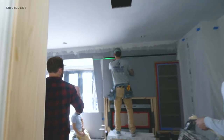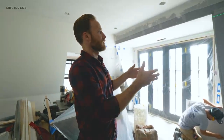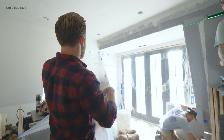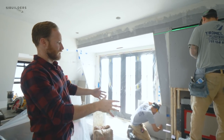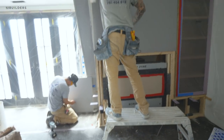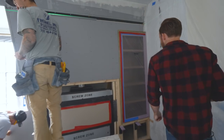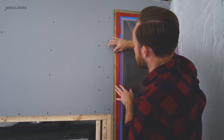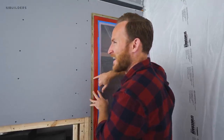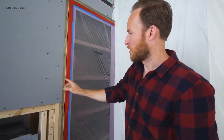The plasters are back on site - Colby and his team are working on this fireplace. At our Back Bay project we had that cubic concrete-looking fireplace; we're doing something very similar here using a product called Limestrong. Everything in this room will be painted with the exception of this cube - same idea, we want it to almost look as though it was extruded up from the floor. You can see the steel brackets on the wall where we're going to have a floating piece of stone underneath. James and the guys in the shop built an awesome walnut bookcase on the side here, and Colby's team has worked with James to create a small quarter-inch shadow reveal all the way around that walnut bookcase - being intentional about separating the materials.